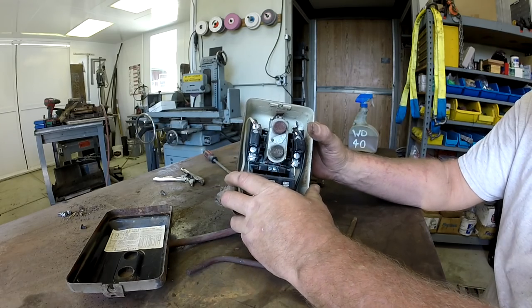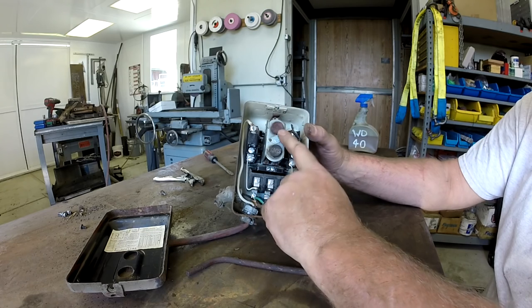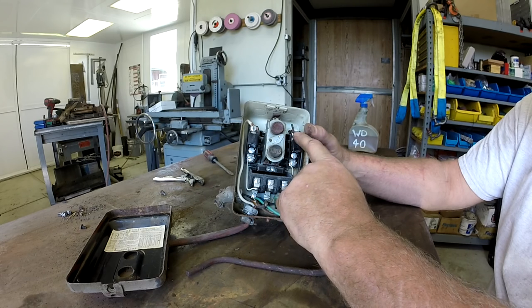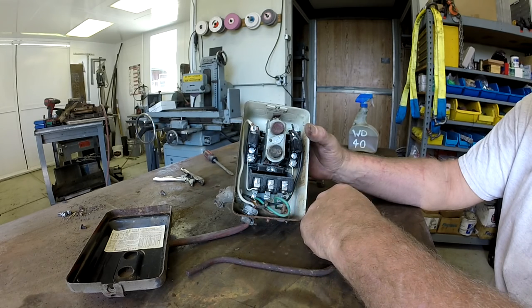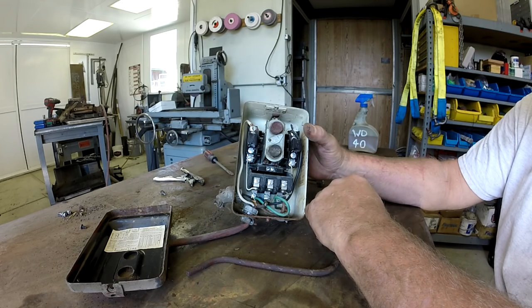Instead of having an electromechanical link, we're going to have an all-electrical link. And we're still going to use a manual motor starter, but a shunt is not really mainstream. People don't know that much about them, but we're going to do an end of cycle with it and show you how to make a shunt work and accomplish the same thing.